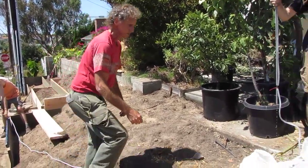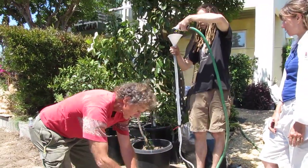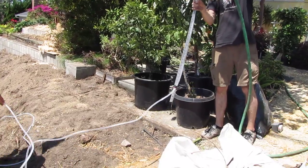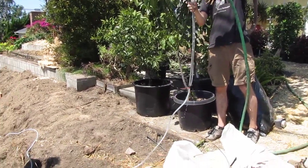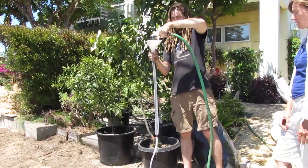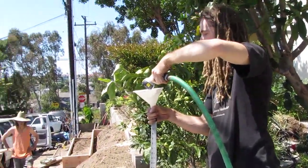You can see some air bubbles in there. If someone can help straighten out that line, it'd be great. The key is with the larger funnel, it allows you to keep the water flowing through with no air bubbles coming in. That's important because the more air bubbles you have, the more it distorts the actual final leveling. So we want to flush the water through to where there's no bubbles left. Then once we hit that point, Dr. Rowley or someone at the very end of that line is going to pick up that level.